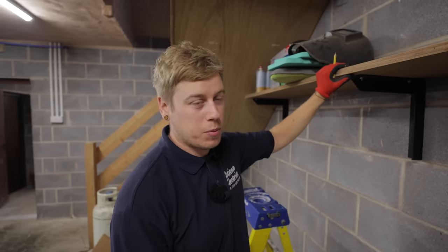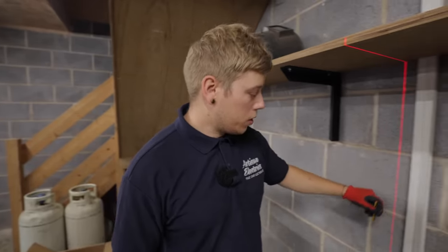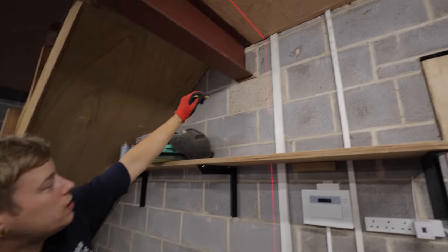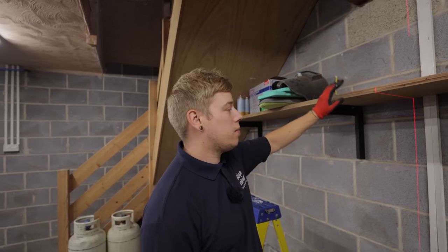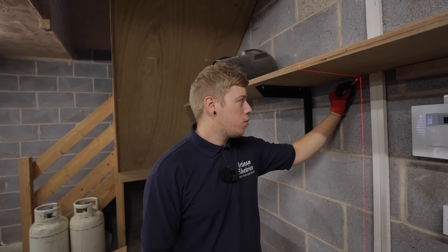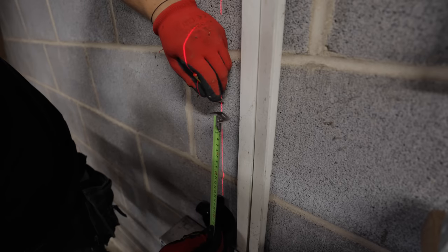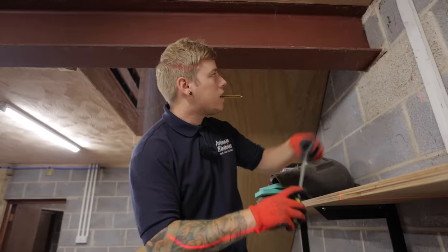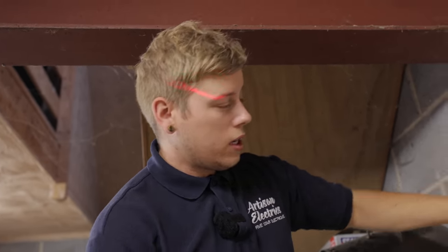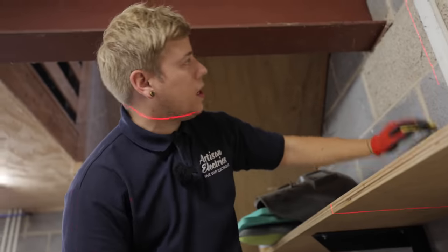From the board we've got our first obstacle which is this shelf. I'm not going to start taking it apart because it's quite a big shelf and it's all bolted down. What I'm going to do is mark my saddle from the T-junction, my saddle from the ceiling, measure in between and do one in the center. Then I'm going to hold up my tube, mark where I want to go through, go through with a wood bit and then jigsaw out the back so it's a nice slot. The shelf's bang on in the middle so I'll do one either side of that.